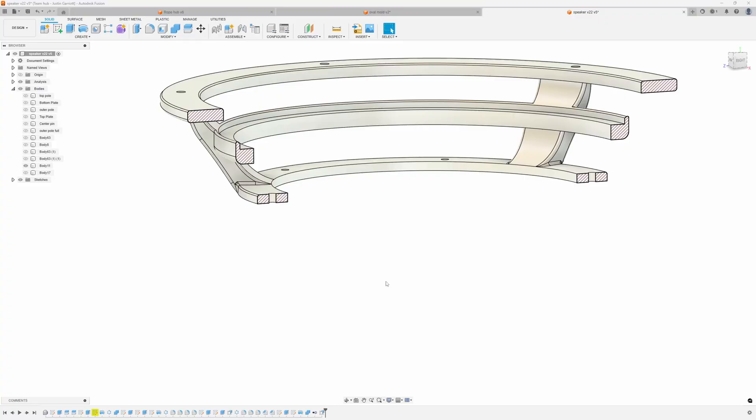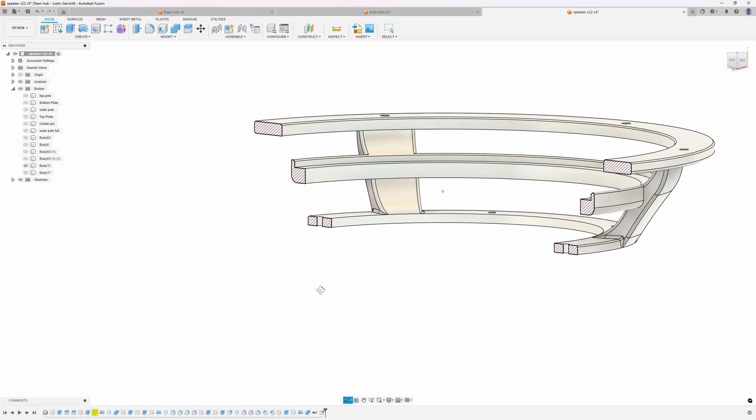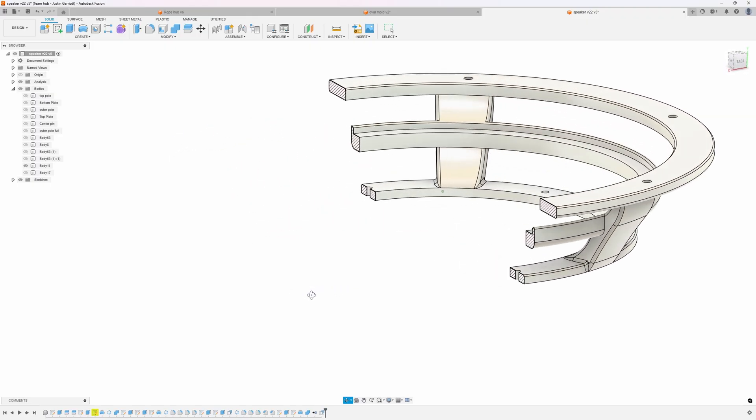I also tried to think about how molten aluminum is going to flow into these pockets and how it cools. Metal shrinks when it solidifies, so I've scaled the part up about 1.8% — a number you'll see recommended a lot when doing aluminum sand casting — to compensate for shrinkage. I probably should have made some sections a tiny bit thicker so the metal has an easier path, because I've never really tested how thin I can cast at home.